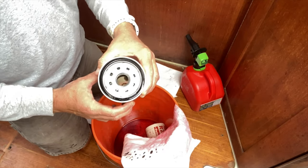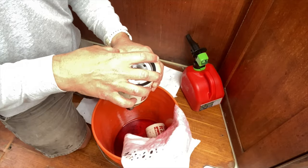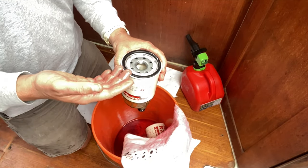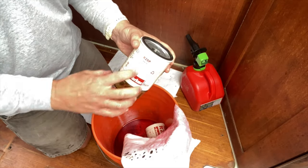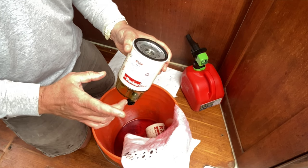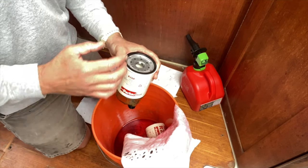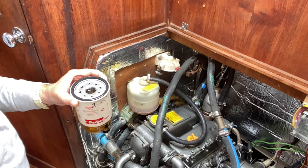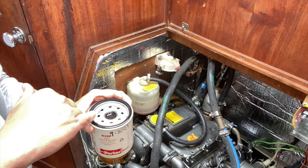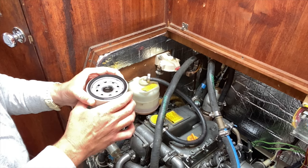My new filter is empty, so if I reattach it to the filter head this way, I will have to pump out and bleed all of the air in this filter out of the system, which will be time consuming and frustrating. So this is the first time when having a gallon of clean fuel on hand comes in handy. I'll reattach the fuel filter housing — I've taken a light amount of fuel and greased the O-ring that will connect the filter to the head of the housing.